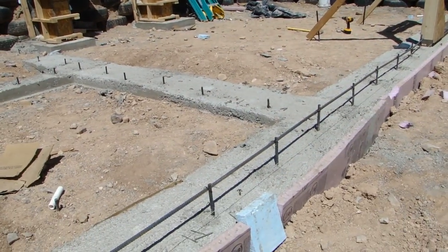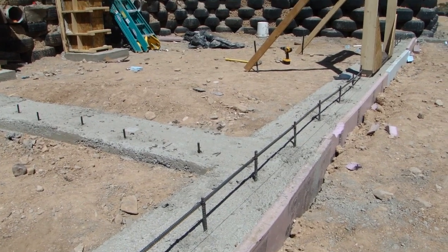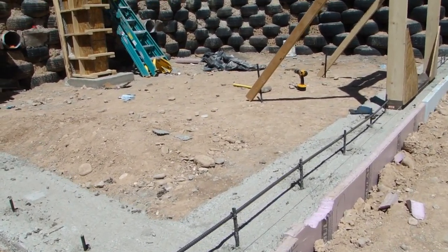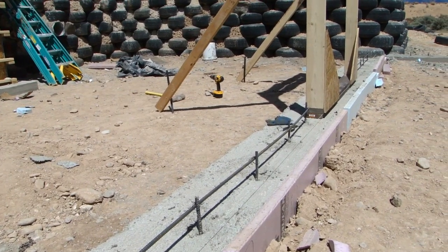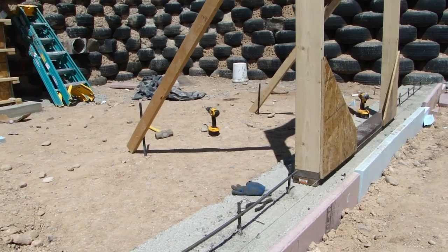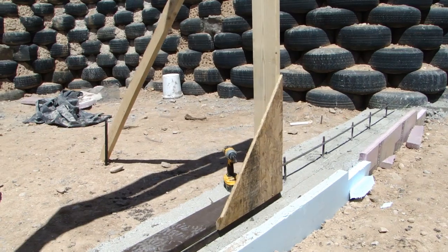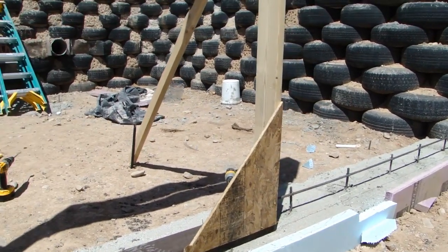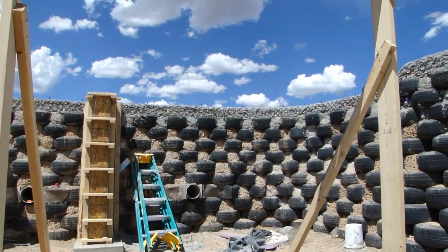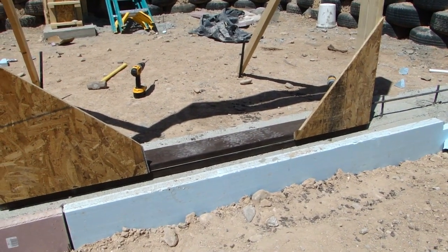What we're looking at here is the rebar sticking out of the interior greenhouse wall footing. This rebar is going to accept a form around it and then a 7.5 inch high stem pour that is going to be the footing for the majority of the interior greenhouse wall framing, aside from the door box which you can see right here, which is mounted directly to the bottom footing.